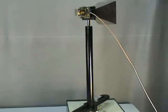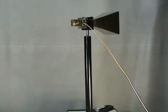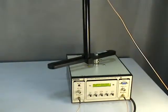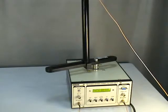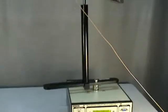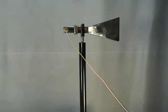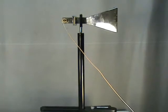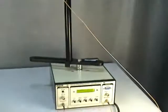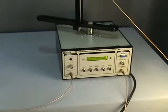The cables used are low-loss Teflon RG316 cables and need to be protected from kinks and loops. Every time the antenna has rotated, the cables should be unplugged from the SMA connectors and then plugged in again. Once the antenna has rotated and captured, for instance, 360 memory locations in 1-degree steps, one can also select 5-degree steps, in which case 73 locations are recorded. The data can then be uploaded to a computer via the RS232 port.